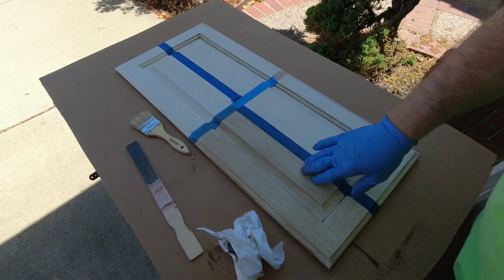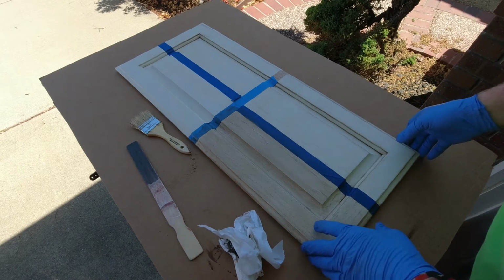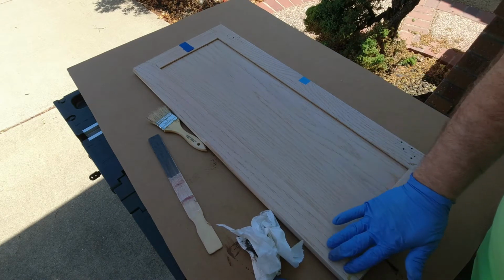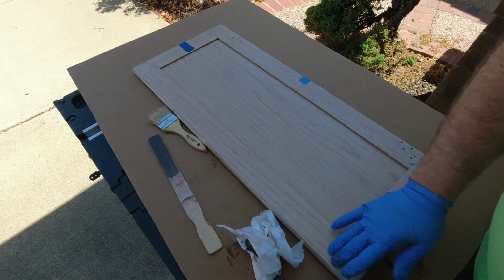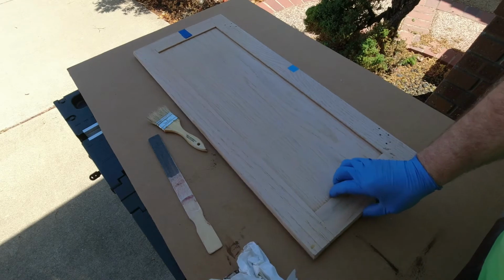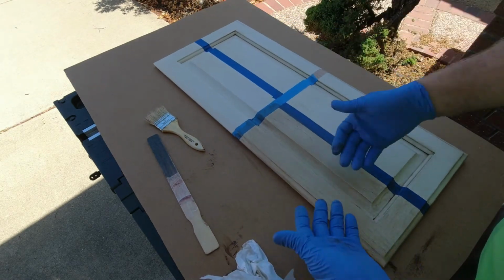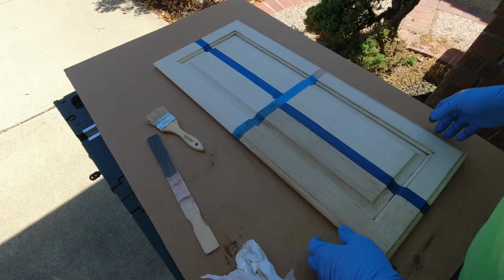This was just a quickie, you know, how would it look on a rough mock-up. I think what I would do, and maybe I'll do it on the reverse side here, is ceruse this side. And by that, I would probably sand this lightly, just enough to get all the oils and gunk off, stuff like this. You can see, yeah, stuff like that. And then I would shoot it with a light coat of primer, not necessarily the milk white, because the effect is the brown glaze on top of the white, not so much what type of white it is.